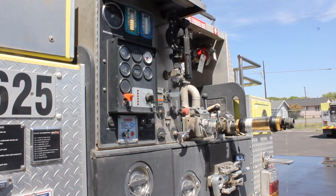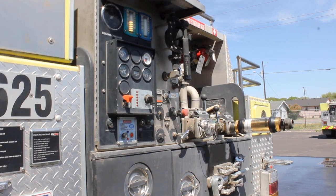The point there is, we lost our prime because at 108 gallons a minute, trickling water into the tank wasn't going fast enough. We got that measurement and we ran out of water, basically. So we'll shut her down and top the tank back off, and we'll go back into this test in just a second, and we'll flow more water into that tank while we do it.